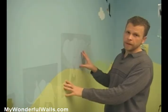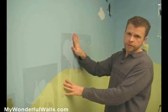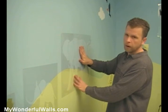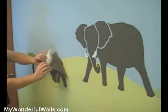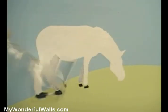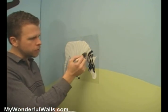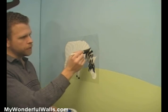If you get any bubbles while placing a stencil on the wall, just peel and re-stick. Make sure all of the outer edges are nice and square, and peel and re-stick the inner components as you work your way across the stencil. For some reason, black paint has a tendency to bleed. So take your time on the zebra stripes — do very light coats, do several of them, and you'll be just fine.